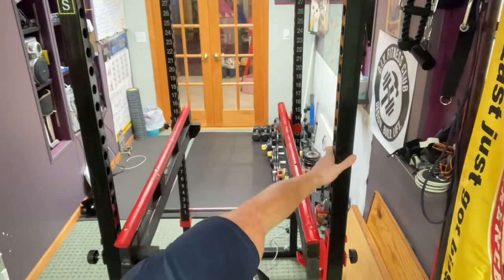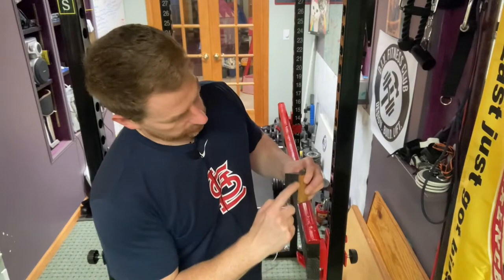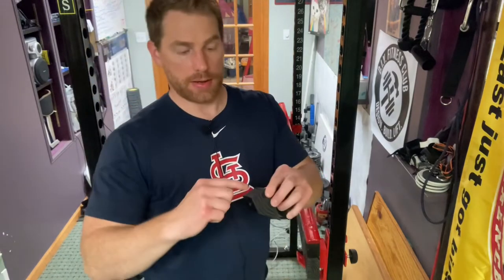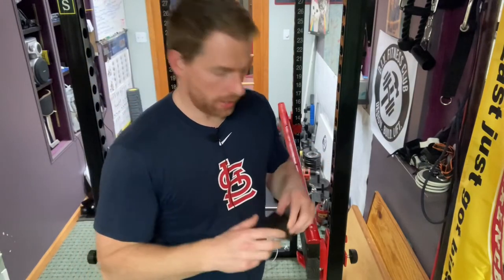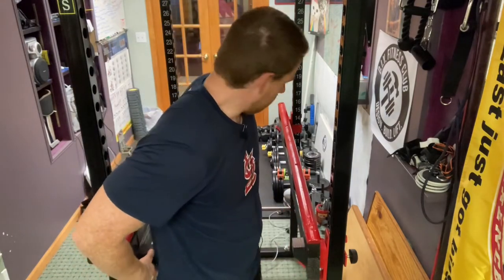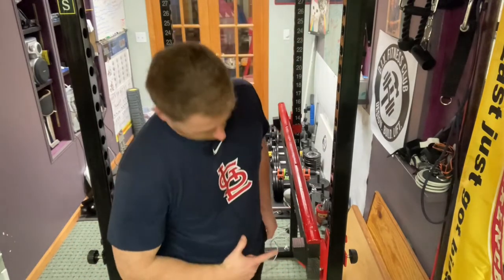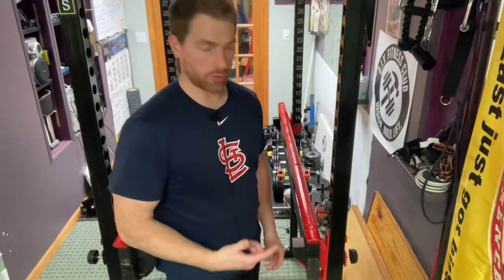On this side, because I put this wood block back here and brought it forward, these are obviously a lot thinner, okay? But again, it's a 45 degree angle cut. They're also as tall as the 2x4, and they are as wide as the J-hook. So these wedges will go right there, and this one will go right here, okay? And we'll put some glue on these four, screw them in, and now it'll be much more stable.